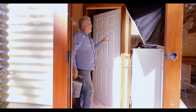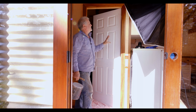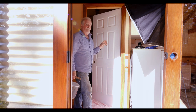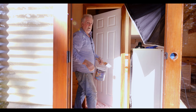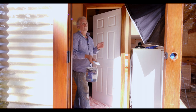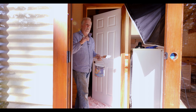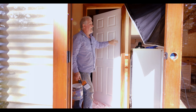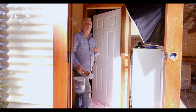One other thing: when I got this door, it was already painted. I knew by looking at it — I can usually tell by looking or feeling it — if it's an oil-based enamel or a water-based paint. That's another reason why I stuck with water-based. I actually prefer oil-based enamels on doors because I think you get a nicer finish. Regardless, you've got to know what paint is already there. You can't just go ahead and put water-based paint over oil-based paint because it's just not going to stick. You know the old trick — you take your fingernail, rub it, and it just peels off. You really do have to make sure you know what you're painting over. I've got another video called 'How to Tell What Paint Is On Your Surface' — it shows you how to find out in a matter of ten seconds. Watch that video; I'll put a card above here or a link in the description below.